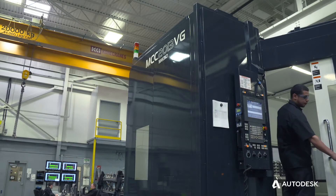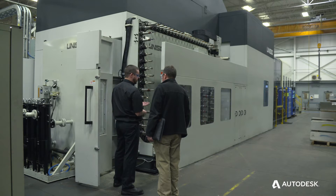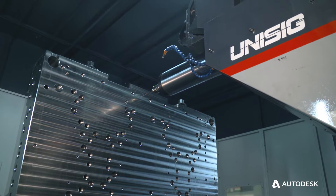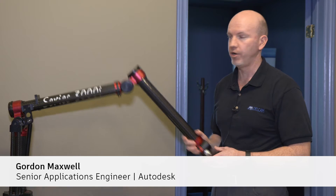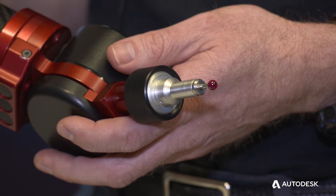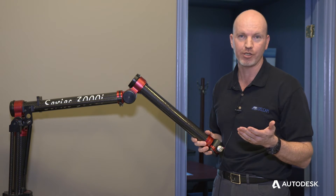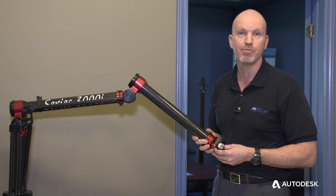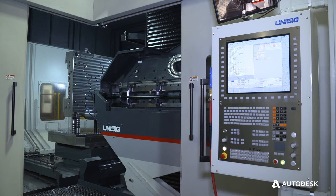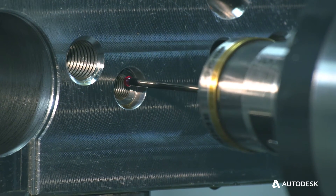If you're a company that's got the correct machinery and the correct controllers, you're probably losing a lot of money and time with those machines not being used for an application like PowerInspect OMV. Common applications would be on traditional CMM devices such as a portable arm you see with me now. What's unique about OMV is that inspection, commonly referred to as verification, occurs on the actual CNC machine itself. The purpose of OMV is not necessarily to be final part inspection but rather to provide great time savings due to its in-process nature.